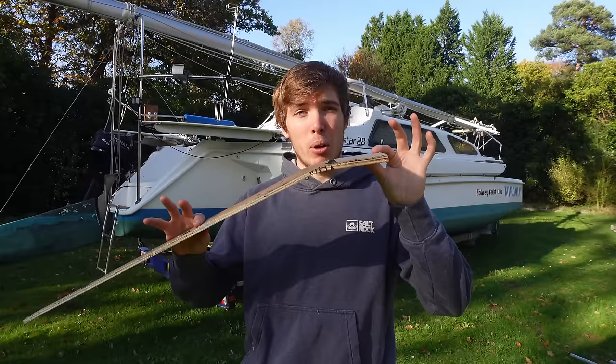In this episode, I'm going to be making up some bunks for that boat so it can sit on this trailer. To do that, I'm going to be bending some marine ply and fibreglassing that, just so this boat can sit just right on this trailer and not be stressed in any of the places that it shouldn't be stressed. So let's get cracking.